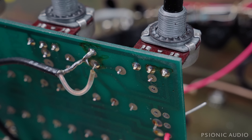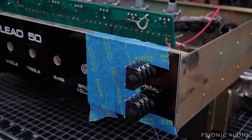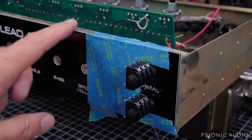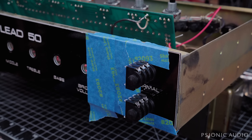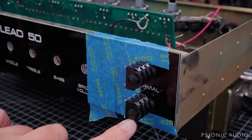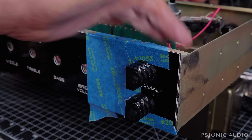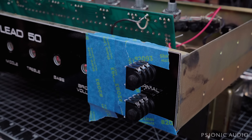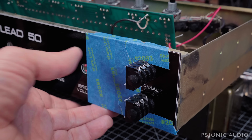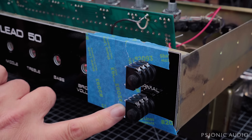You can see I've put the new input jacks here on the outside with some tape here. This does two things: first, it holds the panel in place while I do the work so this plastic panel doesn't flap around and break. Second, having the jacks like this means I can do the new wiring on both jacks from the outside without working in cramped quarters, and everything will have this exact same layout — then I just flip it around and it mirrors itself inside just fine. That's why I have the tape here, so any solder spatter doesn't affect the front panel.